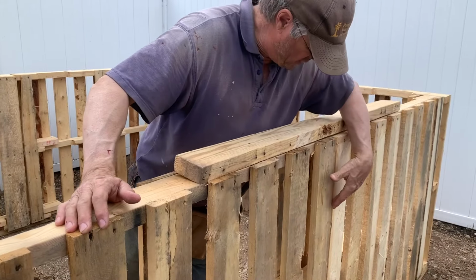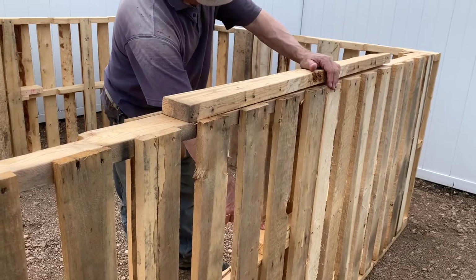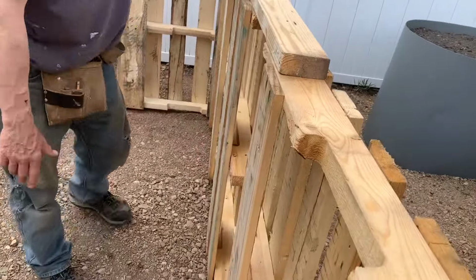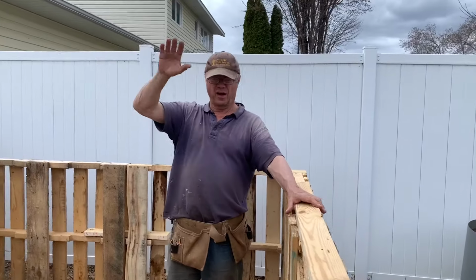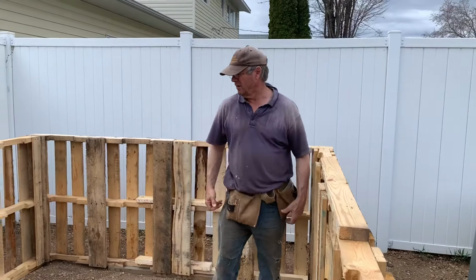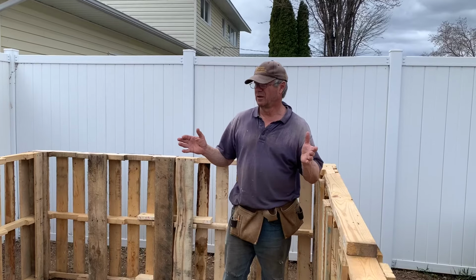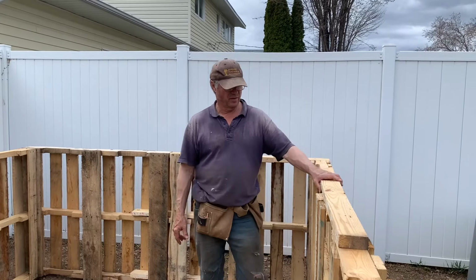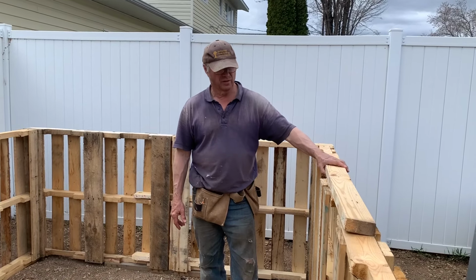Yeah, it's not ideal to have the joints set up, but we put some really good reinforcing here in the middle. Yeah, you got 2x4s in there. Plus, we're going to have beams to tie in. And it's only an 8x8 shed. If we were building a 12 or a 16-foot building, I would probably not do that. But I think we got enough of these 2x4s that we can get away with that. So I think that's what we're going to do.